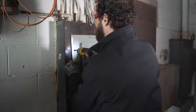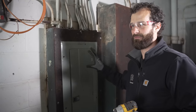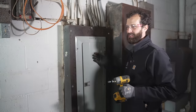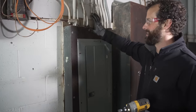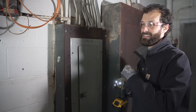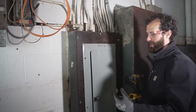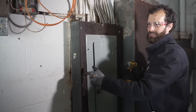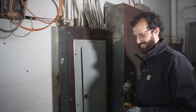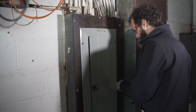So this is actually a pretty common practice. A lot of electrical panels are installed in hallways in school facilities, government facilities, where they're like concrete block corridors and things. The Oaks Academy has this, you know, it's just all over. And so these old panels are embedded in concrete. So to actually replace them is just insanity because you'd have rigid conduits coming in top, bottom. I mean, if you found one that was the exact same size and just slid into that opening, how in the world would you ever get the old one out? You know, it's just like, it's brain damage is what they call that. So this is a very common practice.